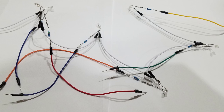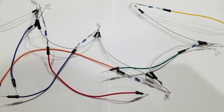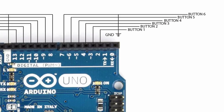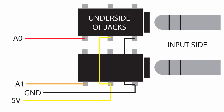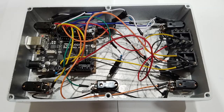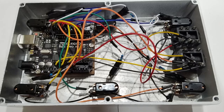The LEDs were similar — I have matching color coding with the buttons they correspond to, as well as the color of the LEDs themselves since they're all different colors. I put a resistor in line to the positive lead and then another daisy chain of grounds going to a second ground port on the Arduino. The buttons go to digital pins D2 through D7 and the LEDs go from D8 to D13. The input jacks I used are Marshall-style barrel jacks — you could use any stereo jack. Both jacks share a common ground and a common 5V connection, one with a lead to A0 and the other to A1. All in all it was a lot of soldering and a bit of a bird's nest in there, but it all worked. I knocked it out in two or three hours and it worked perfectly the first try.